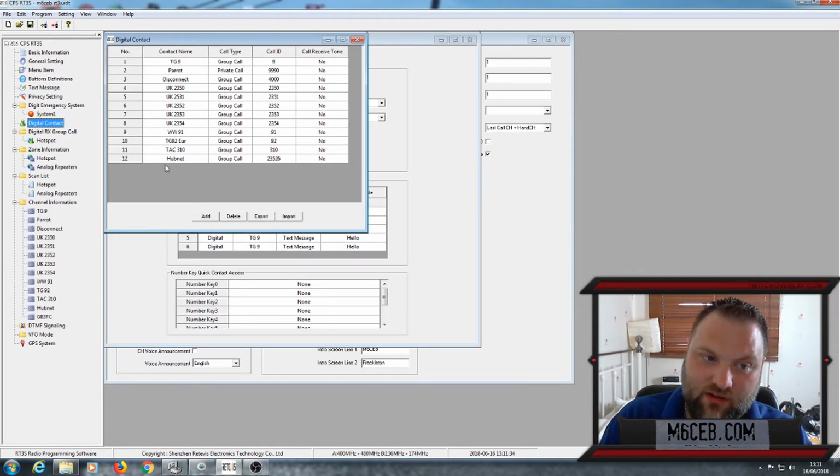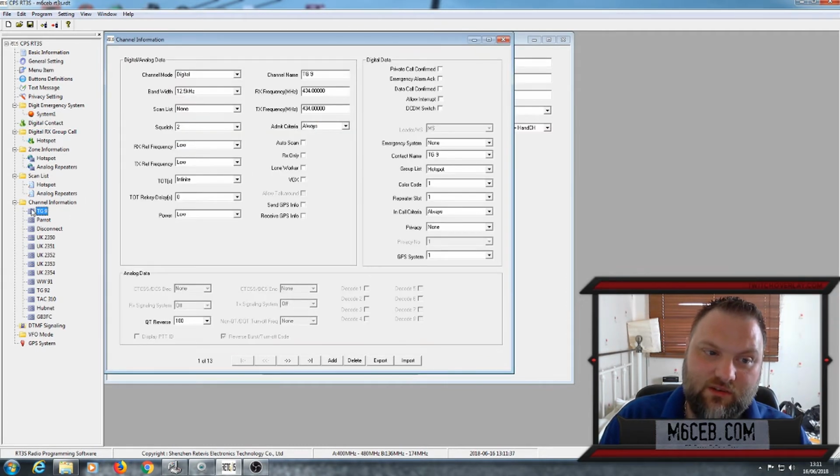That's obviously where you put your contacts in. And then the channels here, the way I usually do it, say if you're doing a hotspot or something, is just do one and then copy and paste them. So say here talk group 9, obviously it would just say channel 1 for you until you've inputted the information. So you would have here digital or analog. Obviously if you're doing digital stuff, you'd put your digital there. Infinite timeout timer, that's what I use. And then you can select your power settings. You can change it obviously while you're in the radio, but this is just as it is when you're setting it up. So yeah, just put low power.